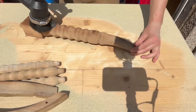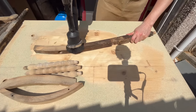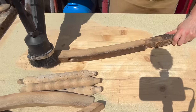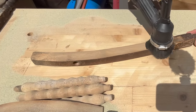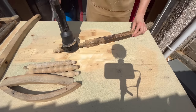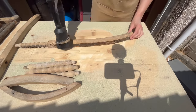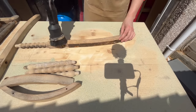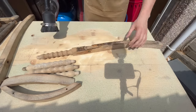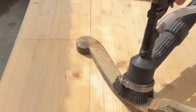This is very powerful and when you have old varnish or paint it really quickly removes it — it's basically like vacuuming, as you can see, this is in real time. It worked great for this project but because there was so much woodworm damage it also removed the superficial layer of wood, leaving holes and exposed damage area. Fortunately, because of what I'm about to do next, this was necessary anyway, so it wasn't a problem — but you need to keep that in mind.